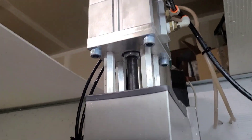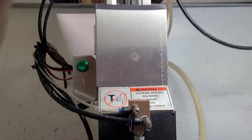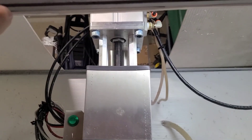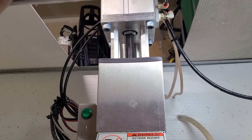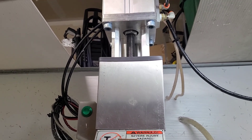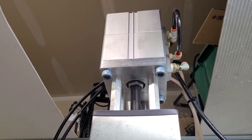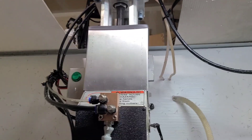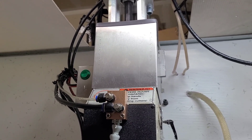It has a pneumatic power drawbar — it's a two-stage design. It requires about 120 PSI minimum, which means you set your regulator there. You're going to need an air compressor that goes up to 150 PSI. I did this to save weight and cost. If you have a compressor with a max of 125 PSI, your pressure will drop too low before it kicks back on and it won't work properly.